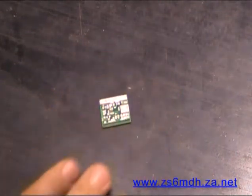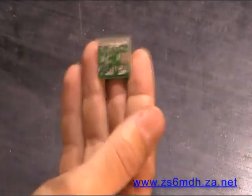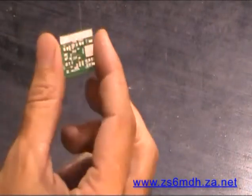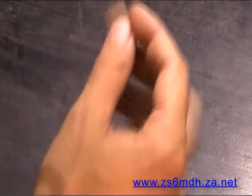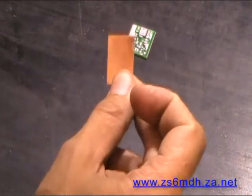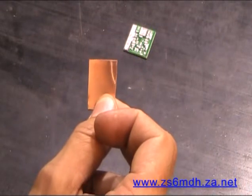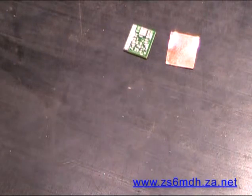Okay, first thing you should have in there is our PC board, single-sided, and has a bit of silk screen, and we can basically stick everything on there. Very important. In order to bring cost down, I've made it single-sided, and we're going to just stick a copper piece of sticky stuff onto the back of that so that it becomes touch sensitive. You can also stick it in other configurations to make it easier for your project, however you're using it.